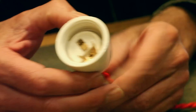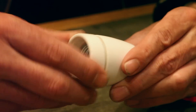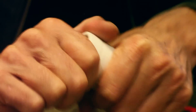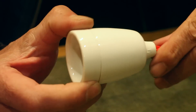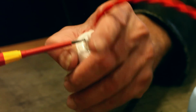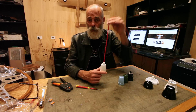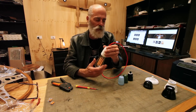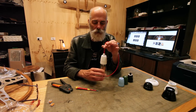Then we do up the second part — the threaded base — which again ratchet locks. It feels like it's crunching but it's actually going over the ratchet, and you'll see it can't come off backwards. Almost complete — the last thing is to tighten the cord grip cable restraint screw back onto the cable to hold the tension. There we have it as a finished bare bulb pendant, ready to install. It will not take a shade — there's no shade ring — this is a dedicated bare globe pendant.